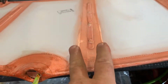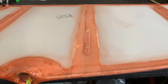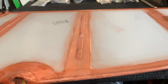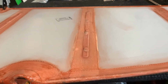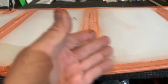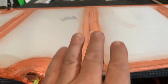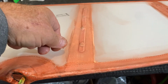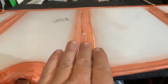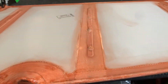You can do pretty much anything with poly brush. You can use the iron on it, just like I say, not too hot that you're just melting globs of glue, of poly brush, I mean. And you can clean it with the MEK, and you can do that all the way up through getting ready for the poly spray. But the poly spray, you can't do that. The poly spray with a silver, you touch that iron on it and boom, it's just done. You have to use a piece of Teflon, like a disc. I think they make cooking sheets.